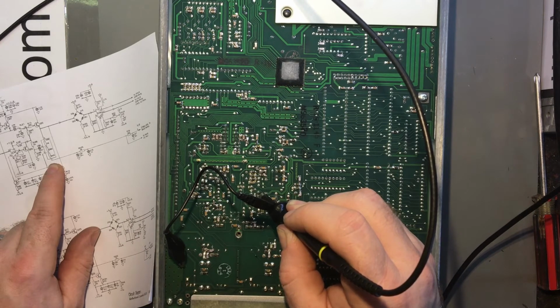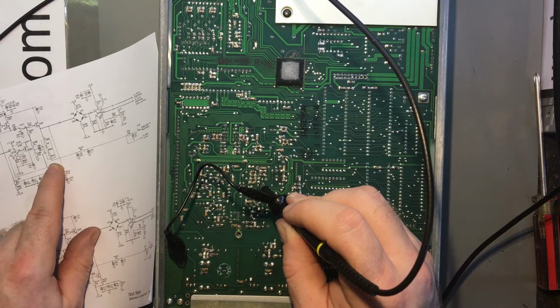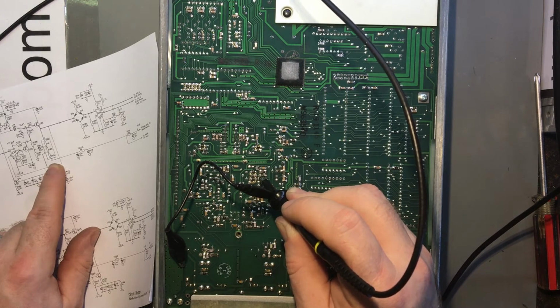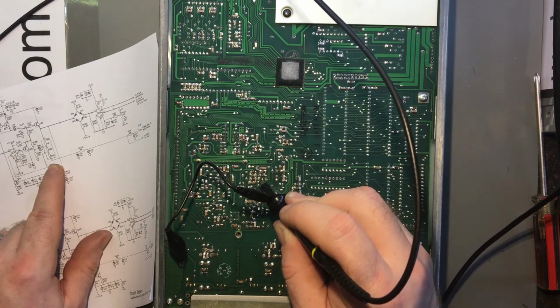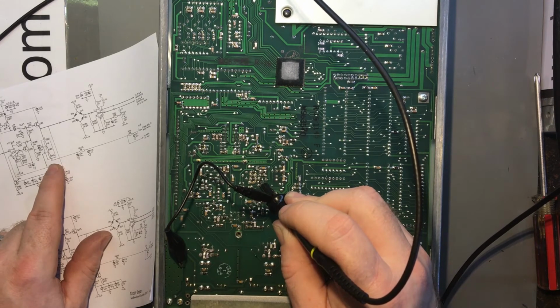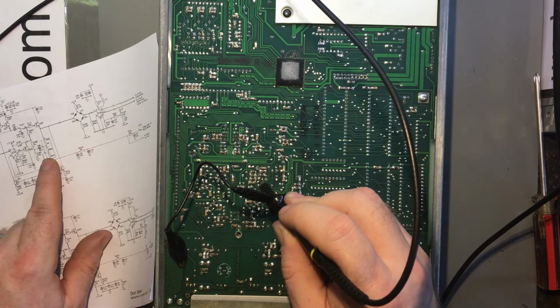There should be nothing. Appears to be. That's pin 3, which is higher voltage. That's pin 4, higher voltage. Pin 5 is higher again, I think. Yeah, not by much. That's what it appears to be anyway. But also on that, pin 5, I'm also seeing the frequency, like I'm supposed to be.